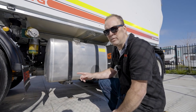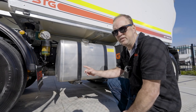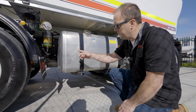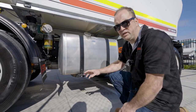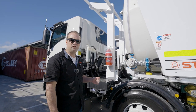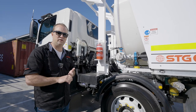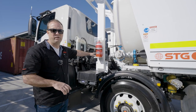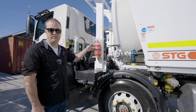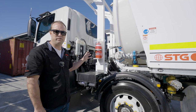This truck is fitted with a PTO-driven water pump, which is actually underneath the truck. It's driven off the transmission, through a drive shaft, straight back to the pump. On a daily basis, we want to get under the truck and check out that pump — are there any water leaks? Is it in good condition? Are all the clamps tight? The second option we do on our water trucks is either the direct drive or a hydraulic driven water pump. If we've got a hydraulic driven water pump, it's going to have a hydraulic tank, a lot of hoses, a lot of valving, generally placed up on the front of the truck. Daily checks for hydraulic: check the hydraulic oil level, check all the hosing is secure and not leaking, check the valving isn't leaking, and do a general look around to make sure there's no leaks which will affect the environment.